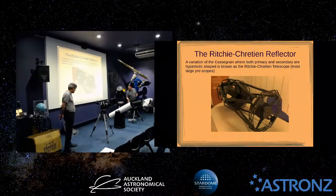So basically what this tool does is it is really just a telescope. It's got a dot marked in the center of it, and it's got a little screen on there, which you can see if I just put my finger on it, just illuminates a screen on the inside of that. And all you're doing is you're looking into the telescope, and you're looking at the secondary mirror, and the reflection from the primary mirror of what's out in the room. You can do this during the day.